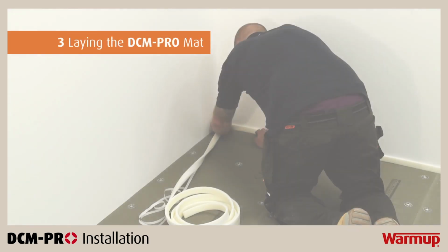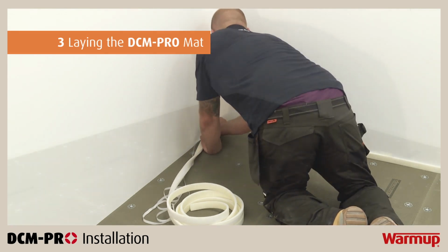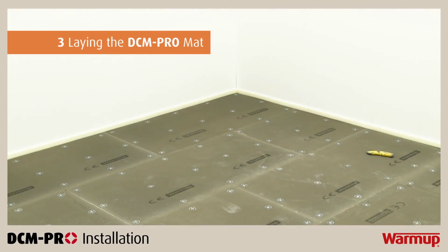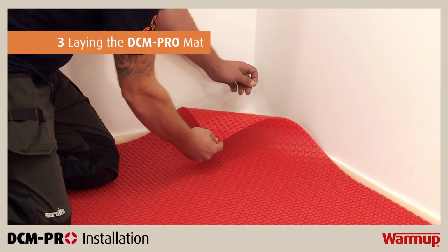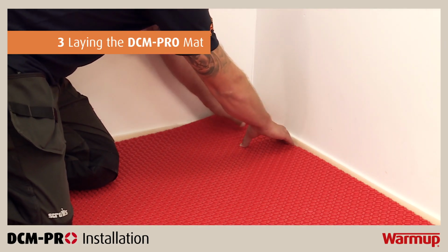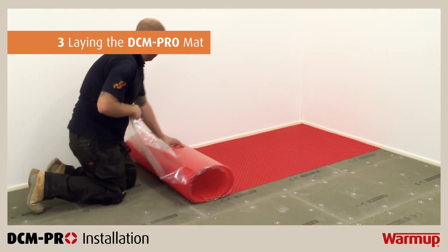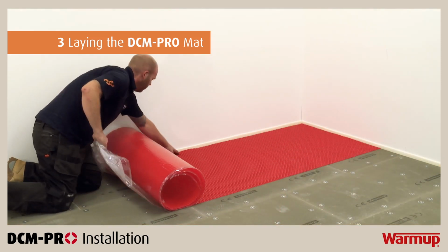Before you begin laying the mat, be sure to have installed the perimeter strip around the corners of the room and on any penetrations through the floor. Partially remove the backing from one corner of the mat and stick in position before removing the rest of the backing. Lay the mat directly onto the insulation boards.